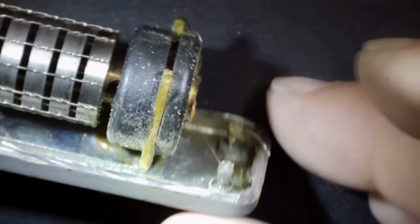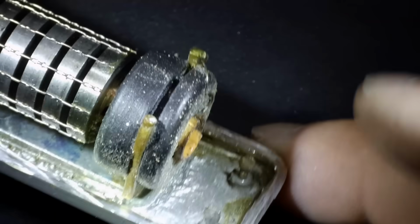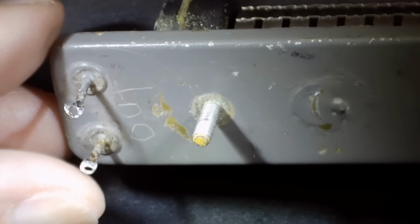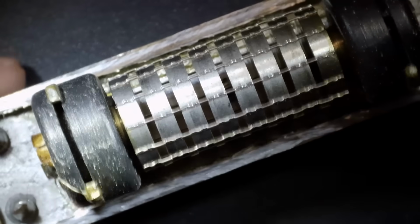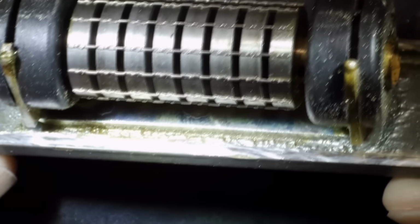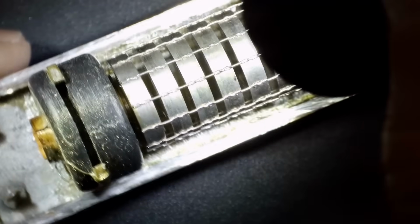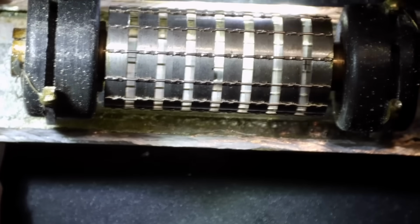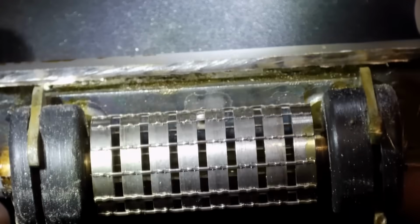All right, here we are in the microscope. You can see these tiny little wires that go to these coils. There's a coil on one end and a coil on the other end, and those tiny little magnetic wires go in the two sides. And then in between are just a bunch of plugs of some type of metal. I don't know if it's nickel or steel, or I don't know what it is. If people know, comment below. But they just are held together by these parallel lines of wire that are kind of spot welded onto the discs, and I guess it gives it enough flexibility that it can resonate at 500 kilohertz, believe it or not. So yeah, it's pretty fascinating. It's quite heavy, surprisingly heavy. So whatever the material is, maybe it's plated brass or something. I don't know. But yeah, there you go. It's pretty kind of basic inside, but it does work.